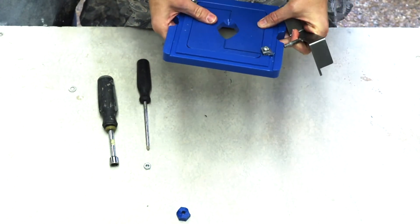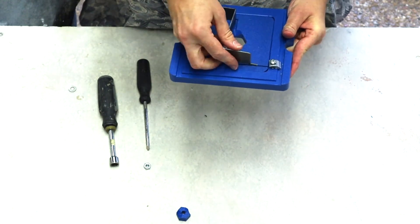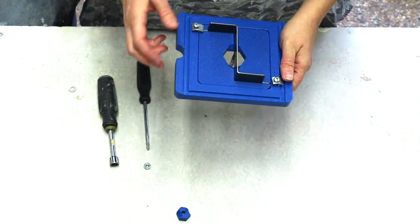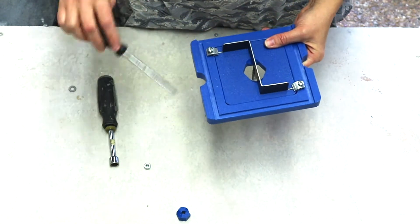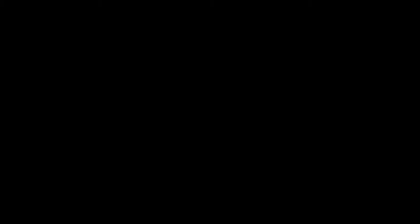The center brace for hollow forms is a little different for this product. Use the center brace shown here and make sure the edge of the metal is firmly inserted into the line of the die. It is important that the center brace ends are secured by the locks on the adapter die as shown. Tighten the locks with a screwdriver.